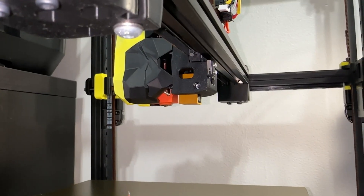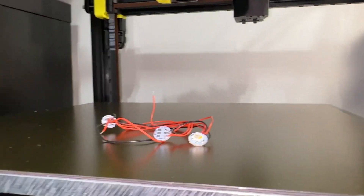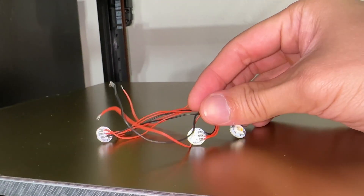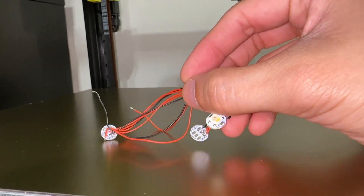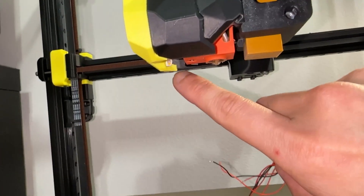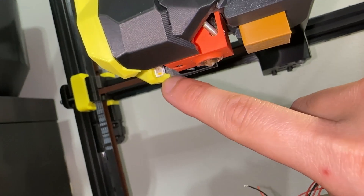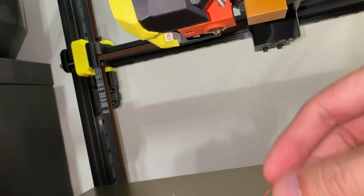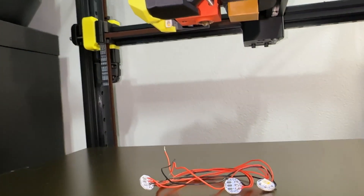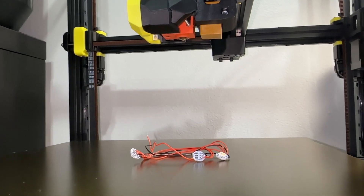The ninth video was assembling the Stealthburner, and hands down the biggest mistake will likely happen when soldering neopixels. It's a pain to solder such tiny pads and you have to shove all that wiring inside thin channels of the Stealthburner cover. Since the multimeter probes can't reach the LEDs, you won't really know if they work until you finish the build, turn on the printer, and configure them. Even worse, sometimes the data signal is too weak, which will require additional modification.